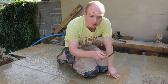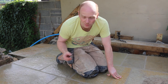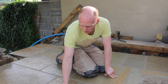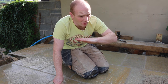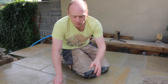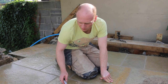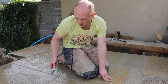We got on okay last night doing the main patio with the fast point. This smaller section has only just been laid and I'm slowly mastering the technique. I probably should have practiced on this one first before tackling the big patio. Doing it at 10 o'clock at night didn't help - you really need good light to see what you're doing. One thing I've improved on: here I've been using a soft brush and a mist on the hose, which is almost clearing all the resin grains off the stones as I go. On the other patio there were little flecks of resin left on the stone, though they should go after a few days. Keeping it really wet and brush-washing it into the joints is working a lot better and cleaner.